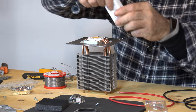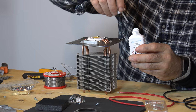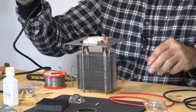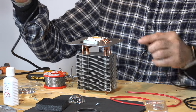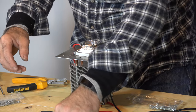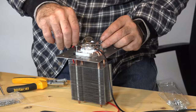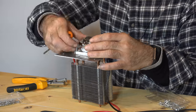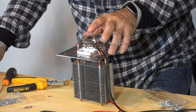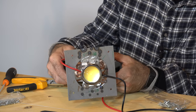I'm going to use a flux which improves the flow of the solder. We need to connect the wires to these points and we want to pre-tin them as well. There we go — now we can actually put the wires up. Now we put the mirror up, we put the lens up, and a bracket to hold the lens in place. We've got the lens in place and now we can continue fixing the back plate into the enclosure.